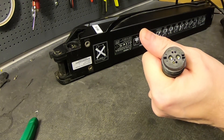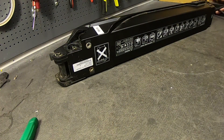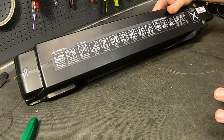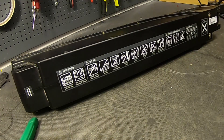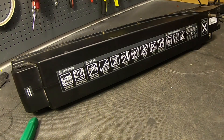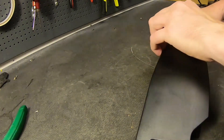The two data transfer pins and one of the two activation pins are missing, so maybe they did something different - something specialized. Normally you need two pins that loop to activate the power in the charger or battery - it's a safety feature for magnetized contacts. I recognize the design a little bit from this label. It says manufactured in China, and from this label alone I'm getting the vibe of Giant battery packs. The more modern design looks similar.